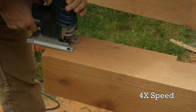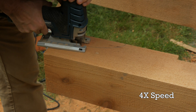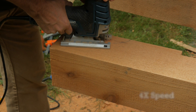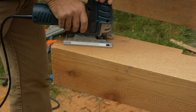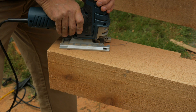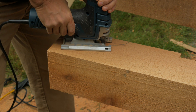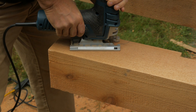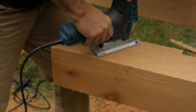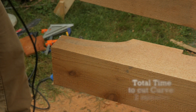These 9-inch blades are fairly wide and thick so I wasn't sure if I could cut this elliptical curve as the radius decreased and became sharper at the end of the cut. The vibration moved the beam on the sawhorses so I had to stop and weigh them down — I just didn't have enough weight on the material. I found the level of vibration acceptable as I was pushing the saw pretty hard with a long heavy blade through very thick material. I used orbital setting number 1 and it worked well and gave me a very smooth cut.